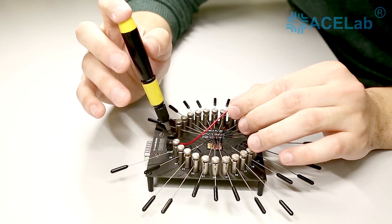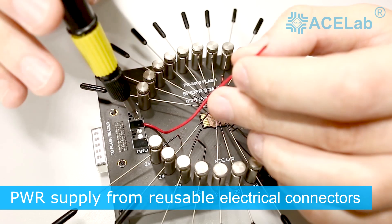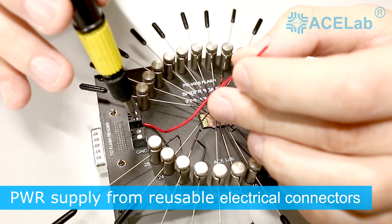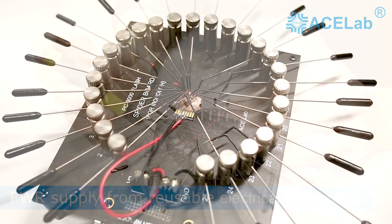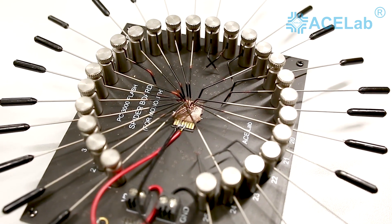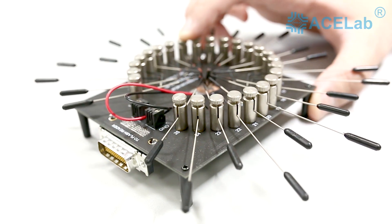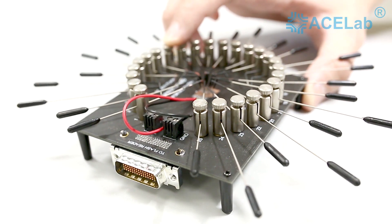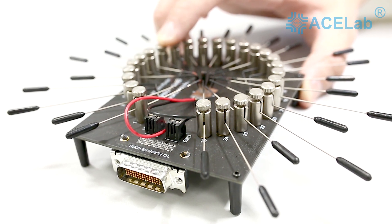If possible, the power and ground contacts should be connected to the monolith via multi-wire conductors with a diameter of at least 0.2 mm. In most cases, power is applied via the monolith's standard connector — SD or USB — which has quite large pinouts for conveniently soldering wires of the matching diameter. The SpiderBoard adapter has screw connectors for power and ground lines, which are convenient for repeated use.